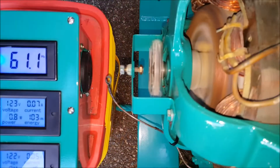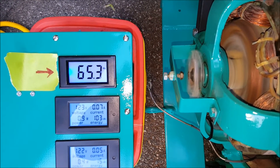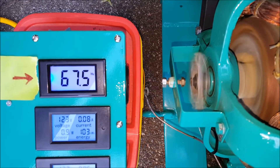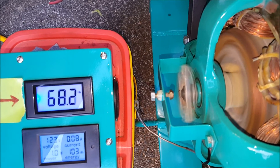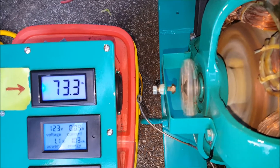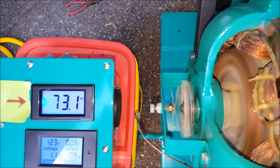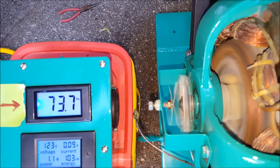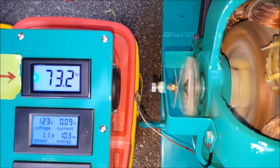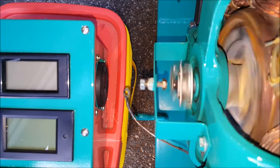We've got about 60 hertz — as you can see, the lever has not popped out. I'm going to start increasing the speed little by little: 65 hertz, 66, 68, 70. I know I'm overspeeding, but — there we go, bang — 74 hertz. That's what I'm going to leave it at. If the wire was hooked up, this wire here, it would have shut down the generator. I'm going to do it manually — I want that arm to retract. I'm going to shut it down manually. Let's see — there we go, it retracts.